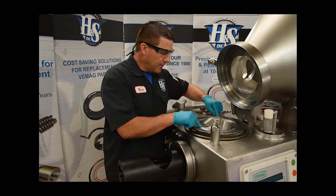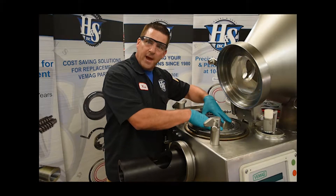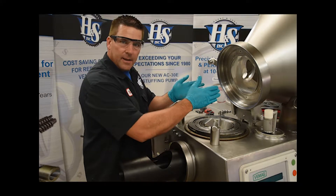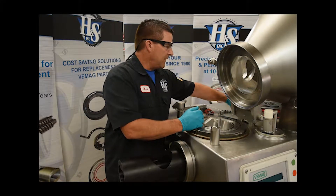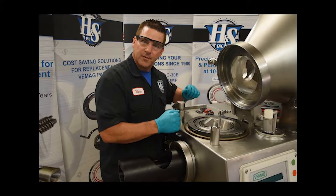I've got all of my bolts tied up here, so the throat of the machine has been fully pulled down and in place. Now you have to make sure that it's rotationally aligned. There are no pins or anything to do that, so you just have to get it close. That's why I use these to get it close. Sometimes you get lucky and sometimes it requires a little bit of manipulation.